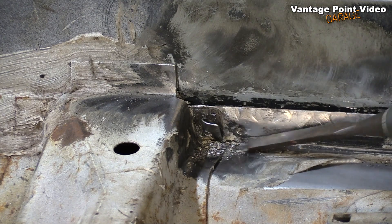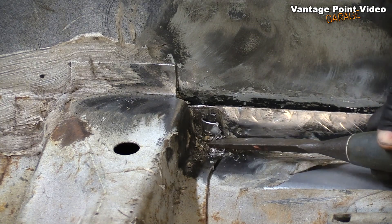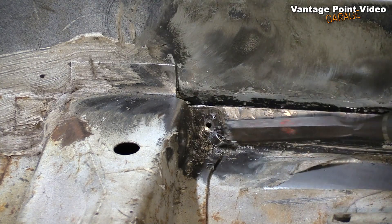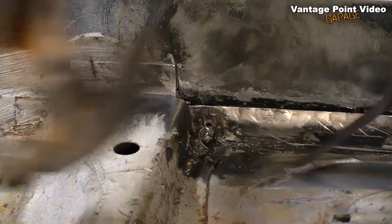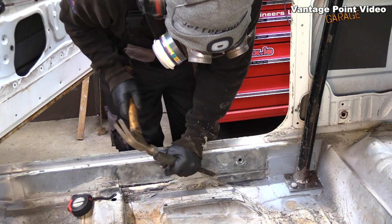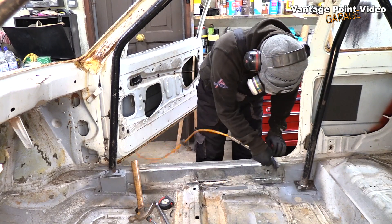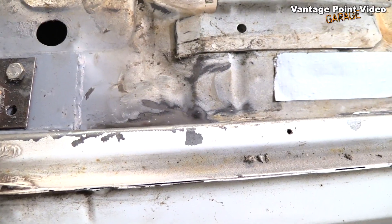Although I'm removing a little bit of material, I'll be replacing it with much more material. I want to mount the bar as close to the original mounting as possible. The right-hand side of this car is going to be my co-driver seat. I'm putting the front support for the co-driver seat just behind the original seating cross member, and for the driver I'm putting it slightly ahead.